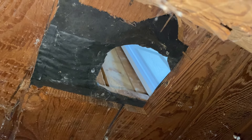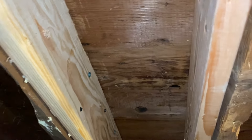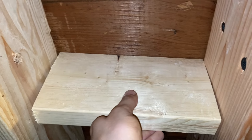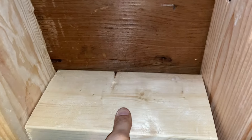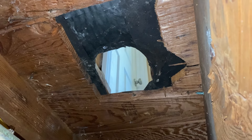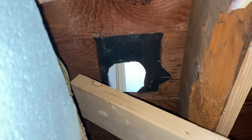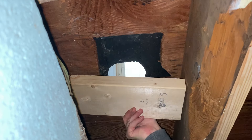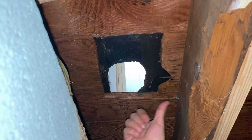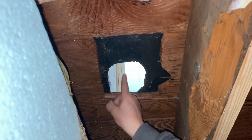For this one, we're going to have to get a little more creative. If I was doing real tile above this, what I probably would do — let's say the hole is right here — I would take some 2x8, go right underneath where the hole is on both sides, attach it real good to the existing joists, and then go from there. But I think I have an easier solution that will be plenty strong for my floating floor. My plan is to take this piece and put it flat up against here and secure it to the joist, and screw down the subfloor into it. That'll be my starting point to work my way back up.